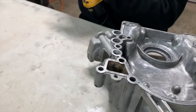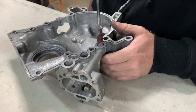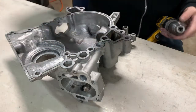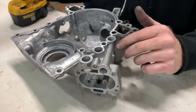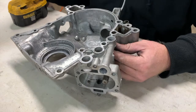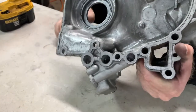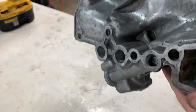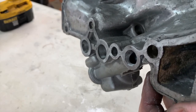We'll come from this side and try to knock that edge off. We've got a sandpaper roll that's shaped like a triangle - it's beveled - so you can actually get it at a sharper angle. What I'm going to do now is take out that 90-degree turn. If it's an 85-degree turn, it's better than a 90. So we're just going to shape it at an angle. You can see this hole here is 90 degrees, and when I open it up I take the edge off so it's no longer 90 - it's probably an 85 or 80-degree angle. It just rounds the turn.